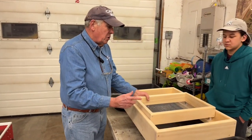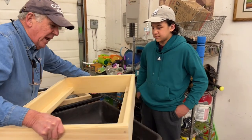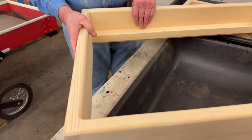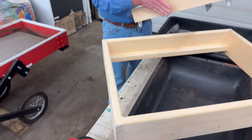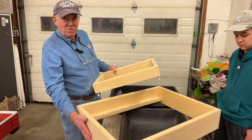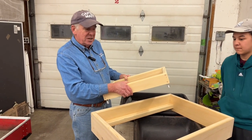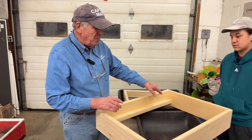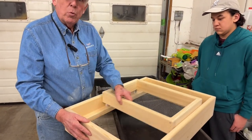So now we're going to use the quarter inch, but I want to put that aside for a minute and show you the construction. This is the frame — basically a five quarter by eight inch frame. We took a five quarter by eight board and ripped it down to size for the frame, and we used the leftover piece as the riding boards. The riding boards are what the wheels ride on as we sift, and it's very important to have that.